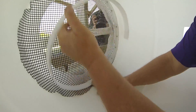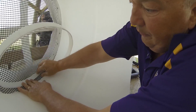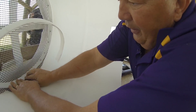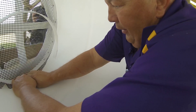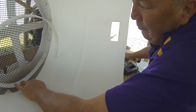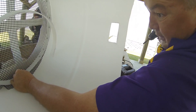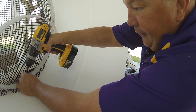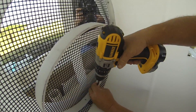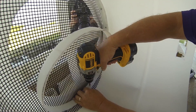Since this is a solid piece of plastic, it's difficult to get it to lay flush — it tends to fold up and get a twist in it. You have to work ahead of yourself to get it to lay flat on the wall as best you can. Put a screw in it, then go back and put another screw behind it to get the remaining part to lay flat. I've got the ring mounted almost all the way around the inside of the drum silo now. When you get close to the end, lay it flat, make a mark, and cut off the excess so it will lie flush with the end.